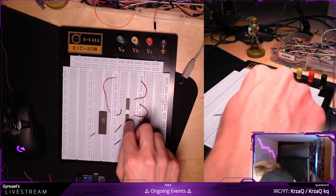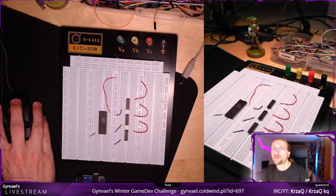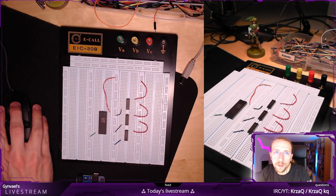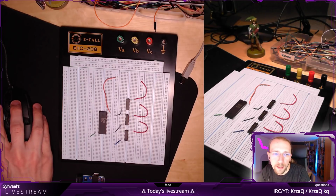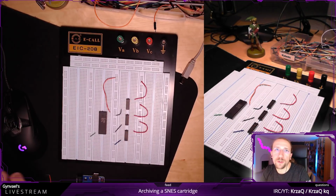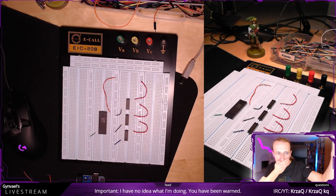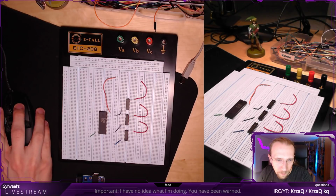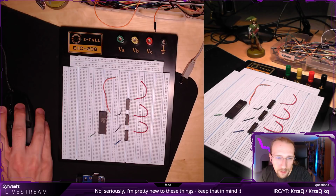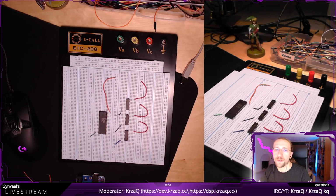Yeah, this is fine. Okay, so we have a ground. Now, I did tell you already that I'm going to tie some of the pins to ground and some of the pins to power, so let's do that. In case of the smaller ones, the shift registers, I'm going to tie output enabled, I guess, and yeah, output enabled only because we need the serial clear tied to VCC.